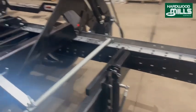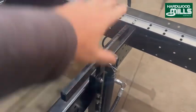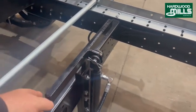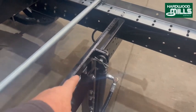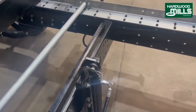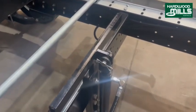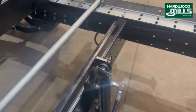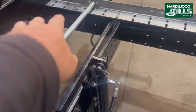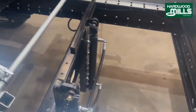These are really solidly engineered. We have the toe board, so that raises and lowers. Say you're on a log — and everyone hates me talking in Imperial, but I will — say that was 30 inches on one end and 20 on the other. What you'd do is bring this end of the log up; it's called toe board compensating. So you're not taking a huge wedge out of it, you do that two sides and you get better grain alignment, better material.